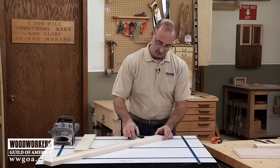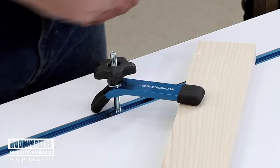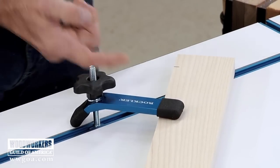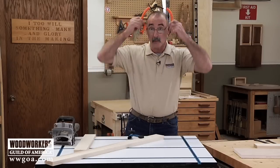In this case, what we really want to do is get a hold-down in place that's going to secure the work. This buys me a couple of different things: one, my work is now nice and solid so I don't have to have a hand there; and two, I know that the bottom of the wood is right down on the tabletop, making sure that the reference surface is the same from component to component.